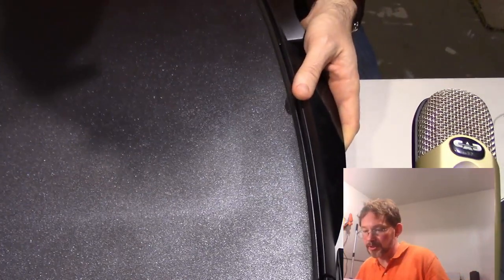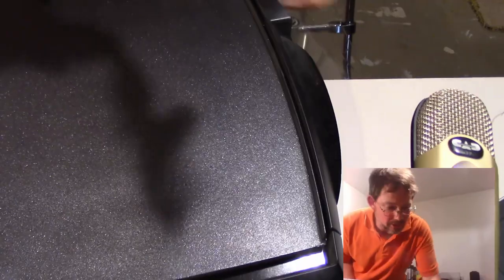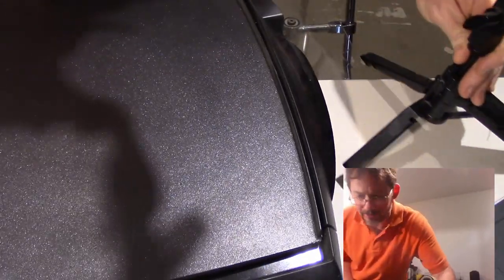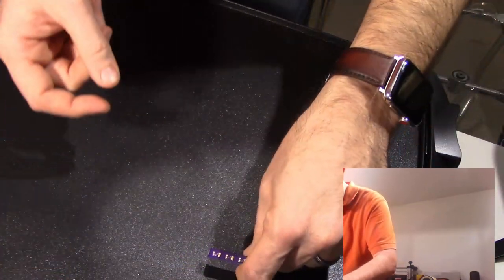By the way, you'll notice that I was a little bit quick and dirty with where I put the solder paste and how I put the components on there. One of the things that happens when you heat up solder paste to 350 degrees is it turns into a liquid and it kind of sucks down the components. And another layer that they put on these PCB boards is the solder mask layer. And solder mask is something which solder will not stick to. And so that's a really handy thing to have if you are doing reflow soldering, because it means that all of the solder will flow away from the solder mask layer and onto the pads. And so everything ends up just kind of flowing together once it hits the magic 350 degrees.